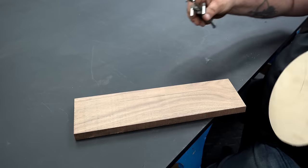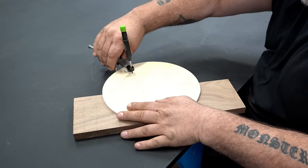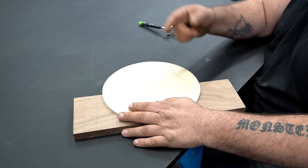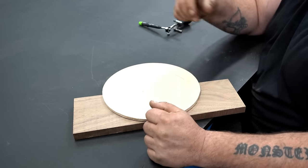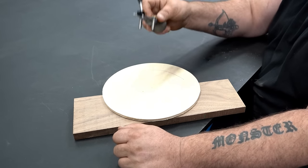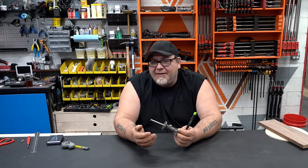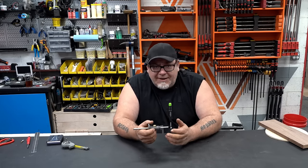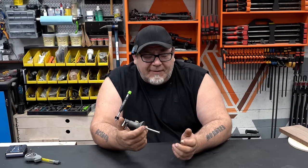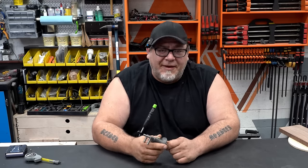These little rollers are great for using straight lines with a pencil. If you didn't want to put a scribe line in and wanted to use a pencil, you can add your pica pencil right back here, lock it in place, and then use the rollers on the front to mark a depth and grab a pencil line. The reason these two rollers are set apart is for marking radiuses — you can very accurately go around a radius and mark the inside or outside. This thing probably gets used more than anything else in my shop for marking. I think I paid about 30 bucks for it — I'll find a link and put it in the description box below.